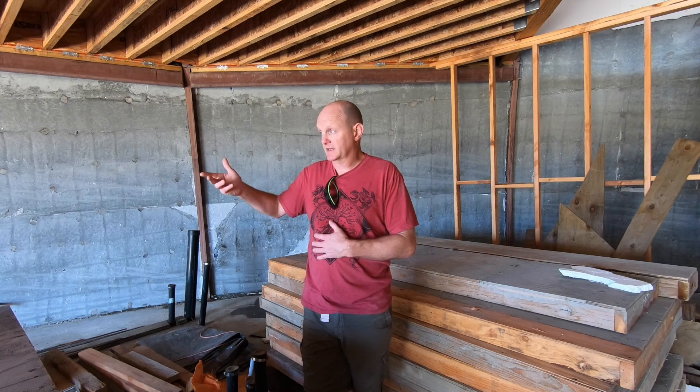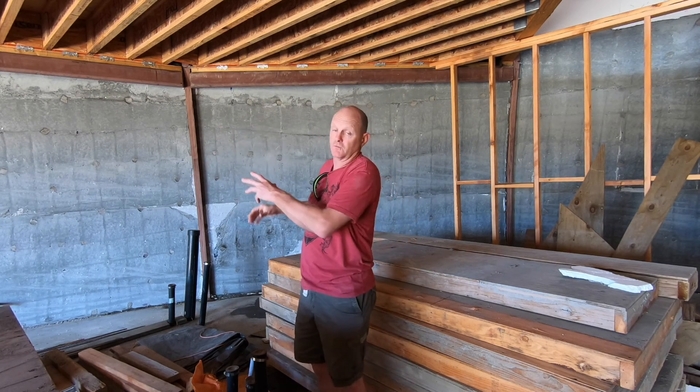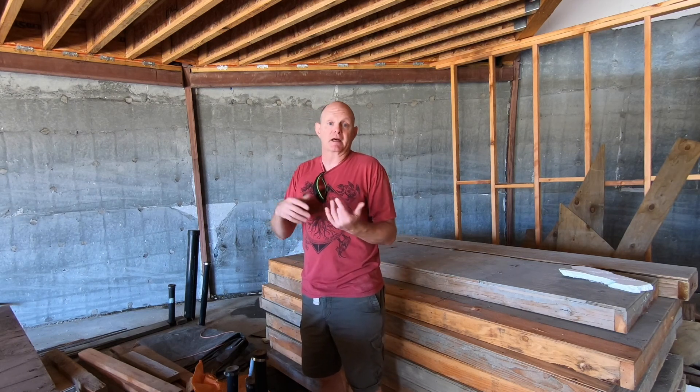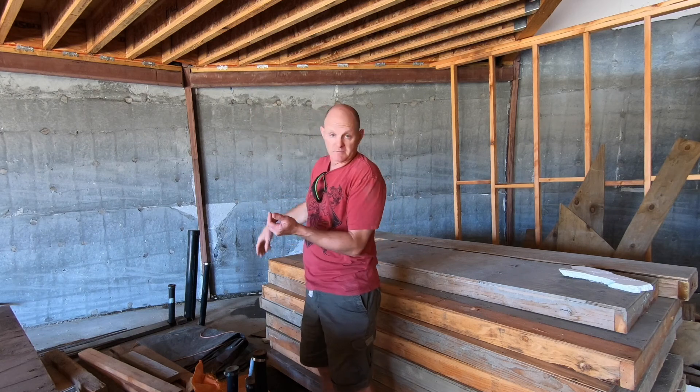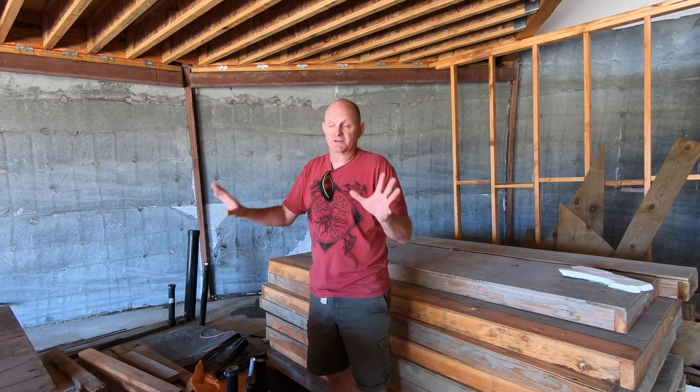We discovered that when we put glue on it first, for some reason it prevented the plaster from cracking. This was a trick my drywall and plaster guys knew about putting plaster over concrete. They did one section of wall to test it — it cracked really badly. So they scraped that off, went back and smeared what I think was Elmer's glue or Elmer's carpenter glue on it, and then put the plaster on. The plaster stuck great, looked great, and didn't dry out and crack.